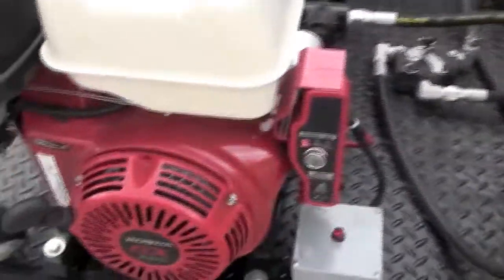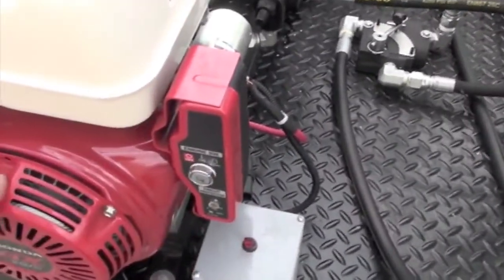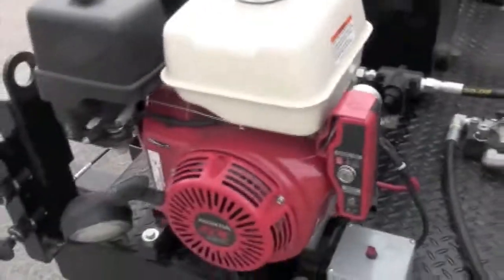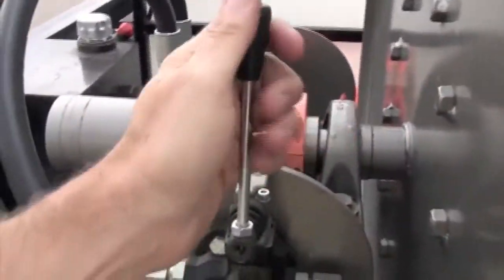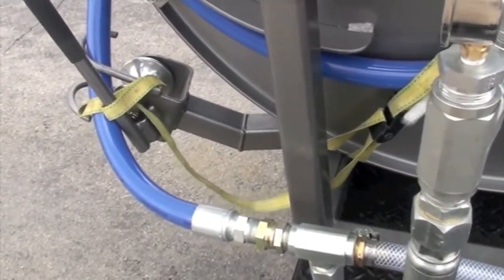Back here is the hydraulic unit. It's good to get that started, warmed up. Start your engines, let those warm up for a minute or two. Let all that kind of warm up, get the fluids flowing. Your control for your hose reel valves right here. So once you start, and you've warmed up, and you've placed the nozzle in the pipe you're cleaning,